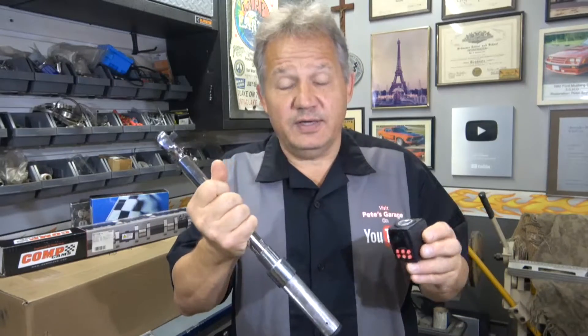This is an electronic torque transducer. It's electronic, it gives you a digital readout, and it measures torque much differently than your torque wrench does. The torque wrench simply detects when you reach a certain torque value — when it sees a certain amount of resistance it breaks or clicks. This actually measures torque value so you can see exactly how much torque you're putting on a fastener.